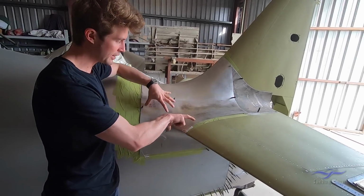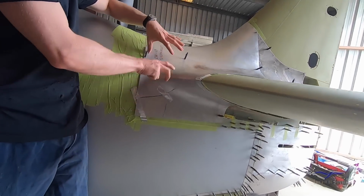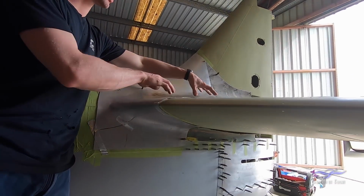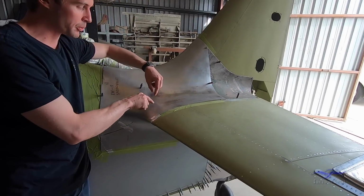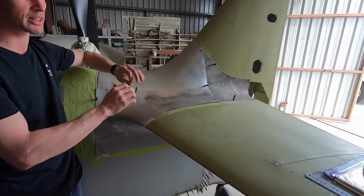So now that we can get this piece fitting, meeting at the wing edge and meeting at this front plane, making sure that all these sections are correct, and then have this back section doing the same thing. It's aligned to this profile, aligned to the wing section. And by the time we overlap the two pieces, we can just do our final cut line and know that everything else is perfectly in place.